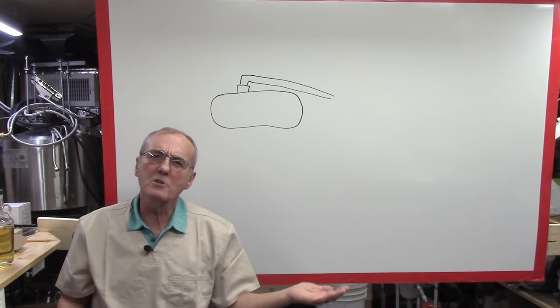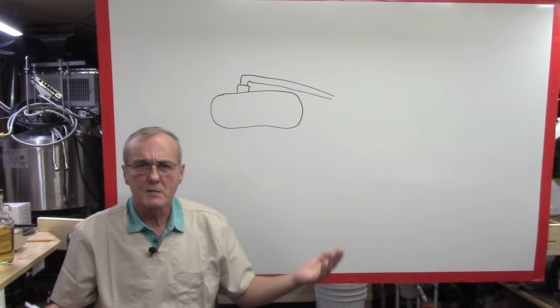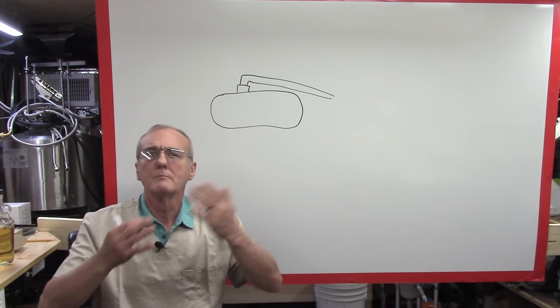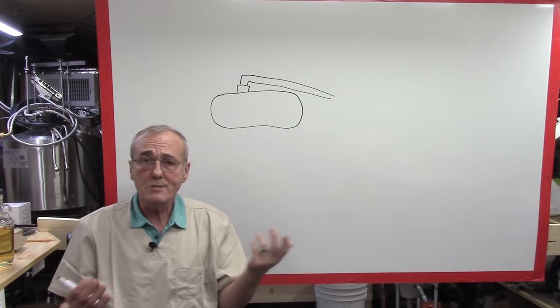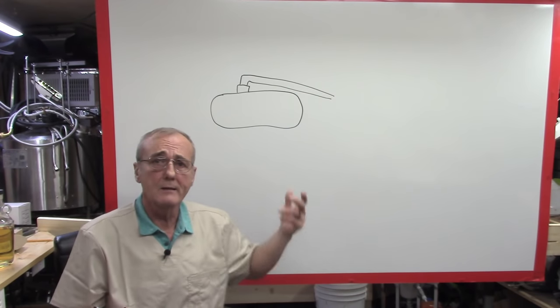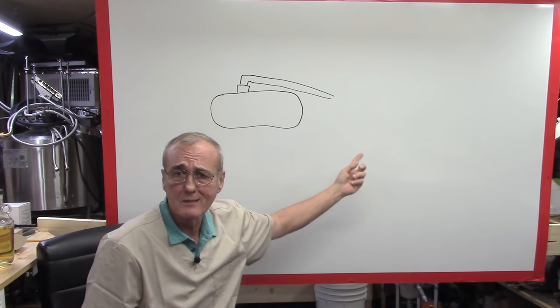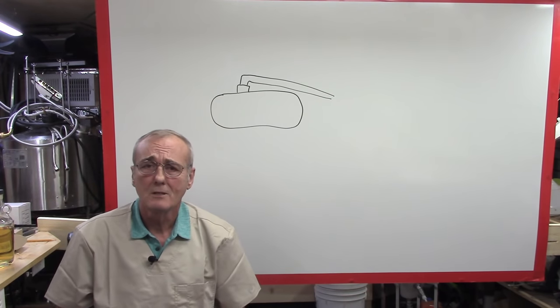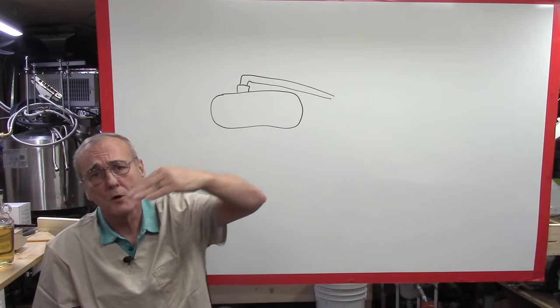And you'll notice that most of them are always built with about a 3-degree drop. And what is that for? It should come to you almost immediately. That's just in the event that anything condenses in the line arm itself, that gravity drags it in the right direction. Okay, you don't want to push uphill. Just let it flow downhill.